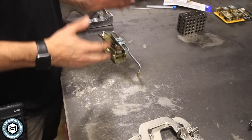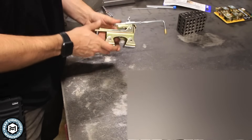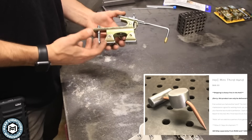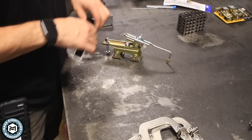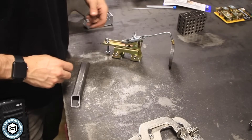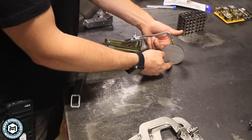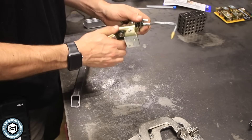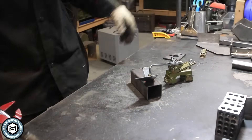Now speaking of magnets, this is what's called a grasshopper, also made by Stronghand. It's got big pad magnets on the bottom and a spring-loaded presser foot. It's similar to what's called a welder's third hand — my friend from House of Chop makes a really great one and I'll throw a link in the description. You put this on your piece of material, and let's say you wanted to weld something down in a strange orientation — you can use this to press it down into place. It's great for round material which is hard to clamp. Using that spring pressure you can tack things down exactly where they need to be. These have a ton of great applications and can really save you time when you need to fixture a strange piece of tab or material.